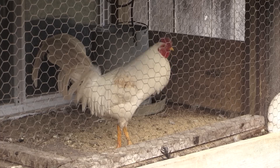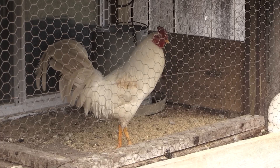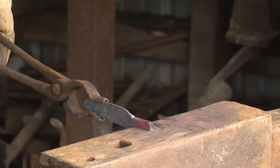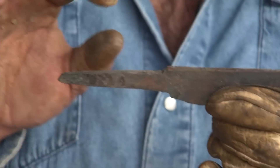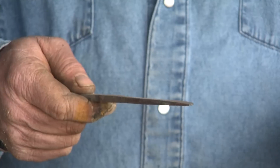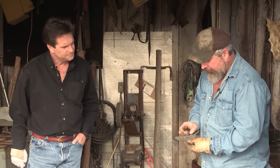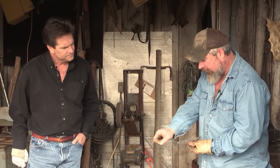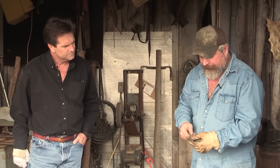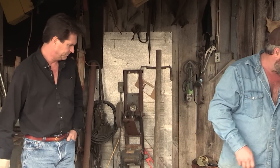Give us all the parts of a knife. What I'm doing right now is the tang, where your handle goes — that goes back in your handle. This area right in here is called the ricasso. And then you've got your blade. They call this taper the distal taper — it goes from back here all the way to your point. So that's it on the forging phase.